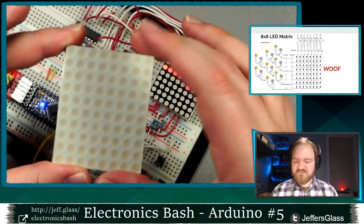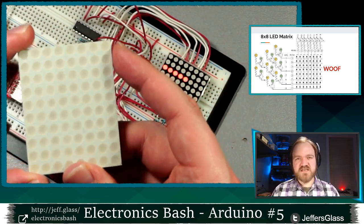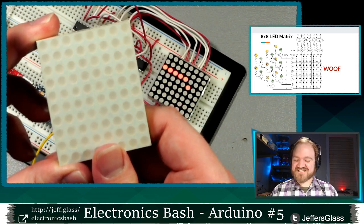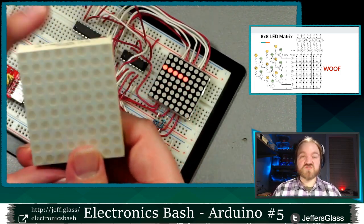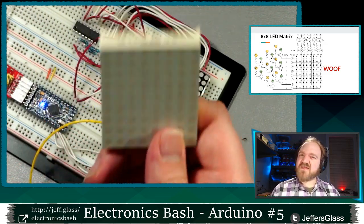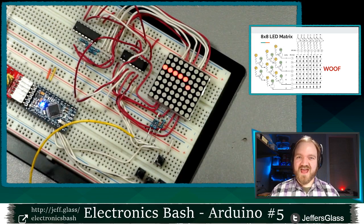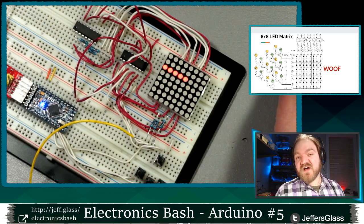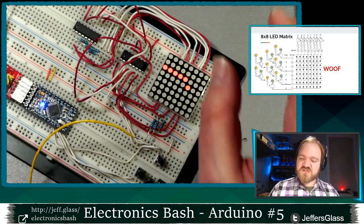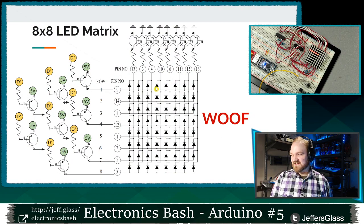This is 8x10, and so already we're talking about 8 plus 10 control pins for this, or 18 pins. You can imagine if the sign was, say, the size of something you would see on the side of the street, you might need hundreds and hundreds of control pins to control something like this, and that's really not particularly feasible for any of the microcontrollers that we have on hand. There are microcontrollers that have a huge number of control pins, but there are better ways. So this is not the approach that we're going to be taking this evening to control our LED matrices.